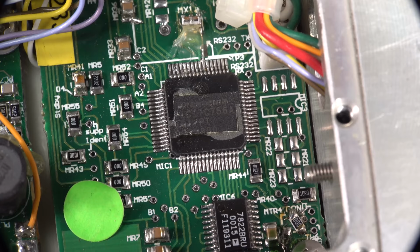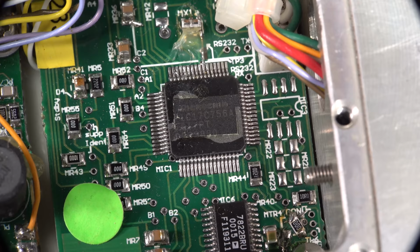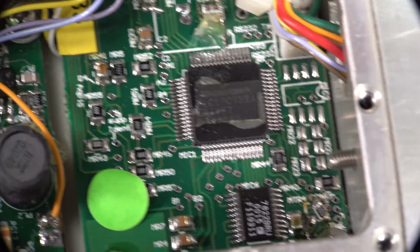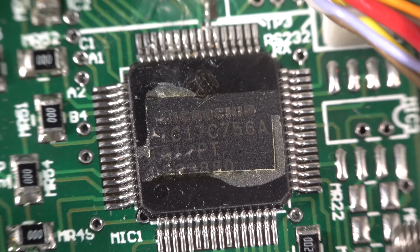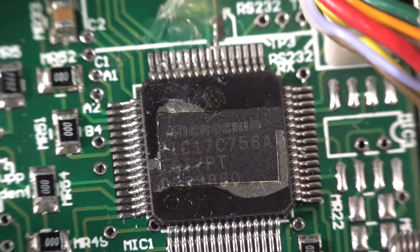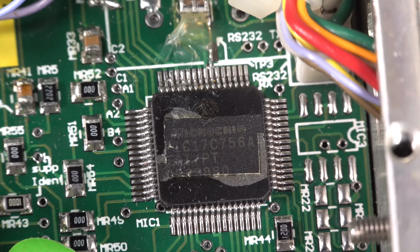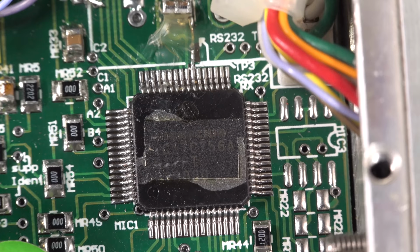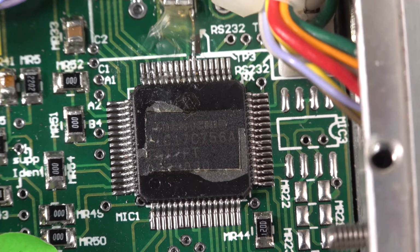The PICs have a good following, especially here in Australia. Microchip would have been a go-to micro solution back in 2000, stuff like that. So yeah, when was this one manufactured? And of course, you see how I peeled off the firmware sticker there, and it's left a big hole in the conformal coat. For those who don't know, you conformally coat boards to keep out moisture from causing leakage on a board. Mix it with enough crud and you start getting low impedance shorts, and that can ruin your day. So conformally coated stuff is very common to find in aircraft and military, industrial stuff where moisture could be a problem.